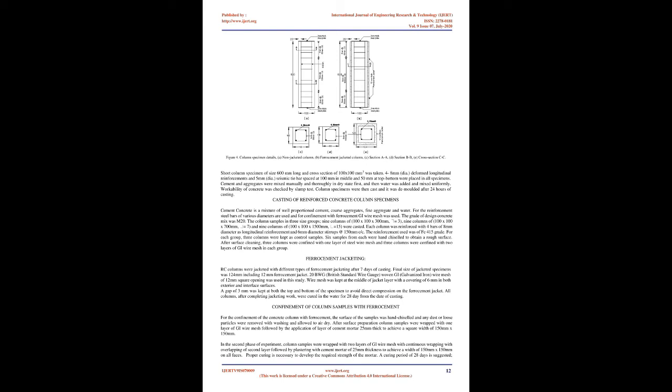Methods. Literature review on ferrocement slabs. Study of code provisions. Collection of welded mesh and other ingredients. Preliminary tests on materials. Design of mortar mix. Jacketing with ferrocement on RCC column. Tensile and compressive strength testing. Toughness and energy of all specimens to be calculated. Analysis of the test results. Comparison of the results obtained.